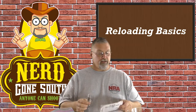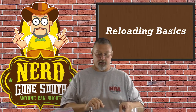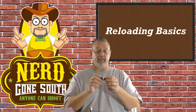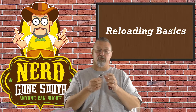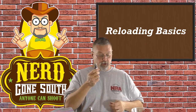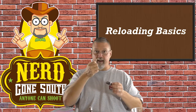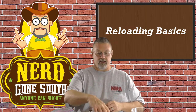This one we've got here is for 38 Special, from Lee. It's the documentation we talked about earlier. This one's got a carbide factory crimp die. It has a carbide coating on it and that makes it so that you don't need as much lubrication to ensure that your cases don't stick. The carbide coating helps with that. This is the crimp die, and what that does is it puts a crimp around the bullet — the projectile at the end — a sort of factory crimp. It puts it back into factory specification, and the crimp on the bullet is very important.